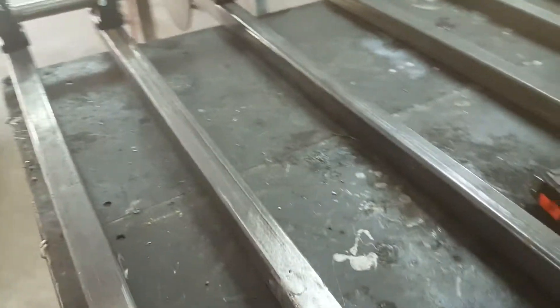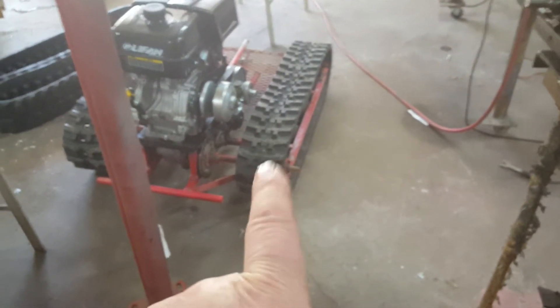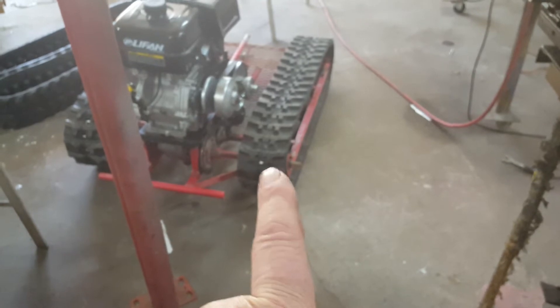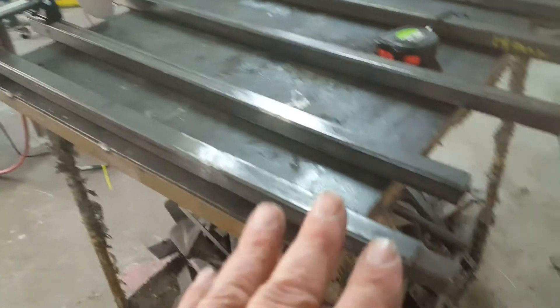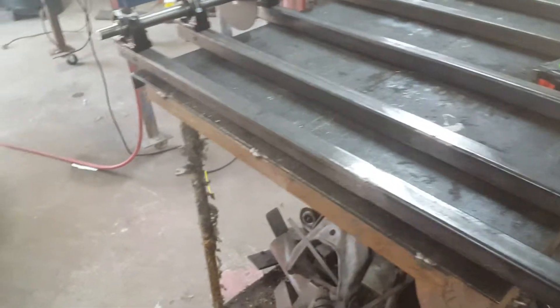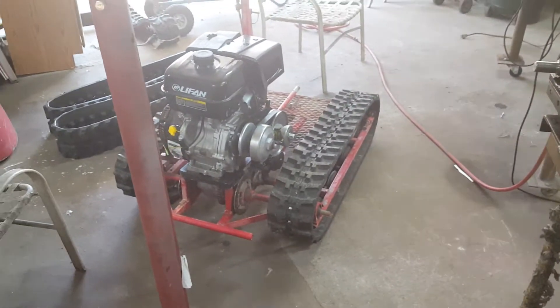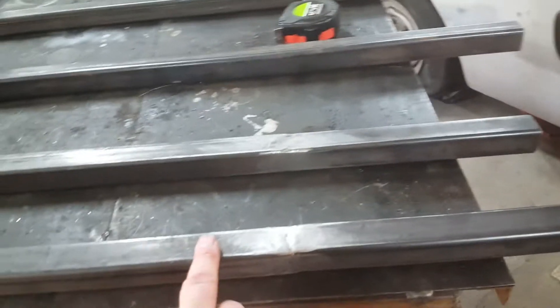Let me give you some quick measurements. We're using tracks that are 180 by 60 — that's the pitch by 39 links. If you multiply the pitch by the links you'll get the circumference of the track. If you use different tracks you might have to do something different, but I've done this once so I know approximately what I need. If you're going to build one of these along with me, make sure you're looking at the 180-60 by 39 Summit Tracks LLC — great people.